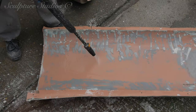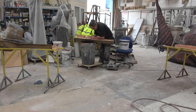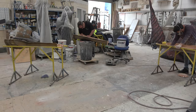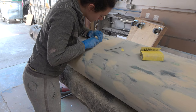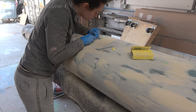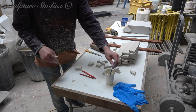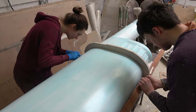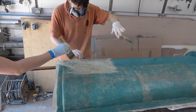After the mould has been cleaned out, we go in with numerous waxes and release agents before a gel coat of resin and glass fibre to create a first cast. From this first fiberglass model, we're making a few tweaks and changes to aid with future casting and we're generally neatening and cleaning up the entire form. The production mould will produce a direct replication of whatever we're creating here, so we want to ensure that everything is finished properly. Plasticine is used to divide the sculpture surface into sections so that we can create boltable flanges to join them all together and open up again for extraction.